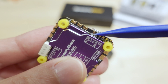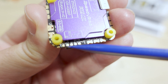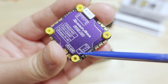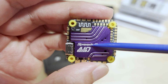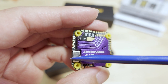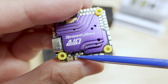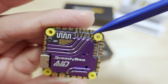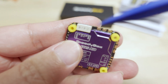Some of these pads are labeled - my camera's having a hard time focusing on them - but you can see that some are actually denoted on the heatsink, which is nice. On this side they have the wireless antenna, which is for the Wi-Fi connection to your app, so if you don't want to use the USB-C port you can use the SpeedyBee app for quick tuning. The big pads here are for your battery connector, and all the different connectors are pretty nicely labeled all around.